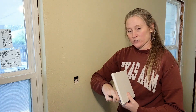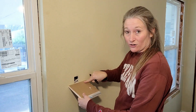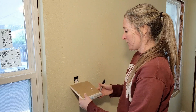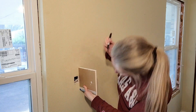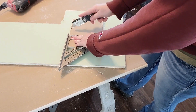I'm going to use my Sharpie on the backside of this sheetrock. I'm just going to hold it up in the center of this side and eyeball where the two edges are, and then do the same thing on the center on this side, eyeballing where those two edges are. Then I'm going to take my square and line it up with each of these lines to score the drywall all the way across.